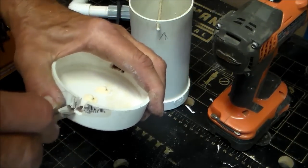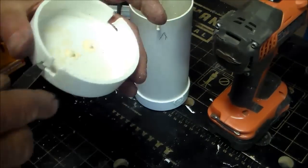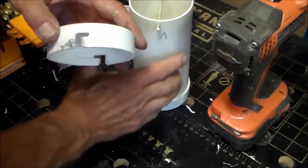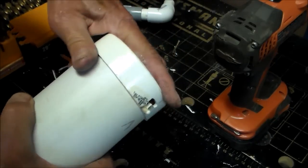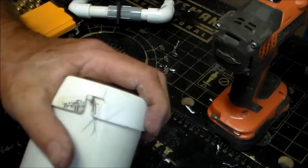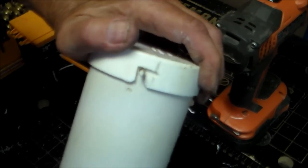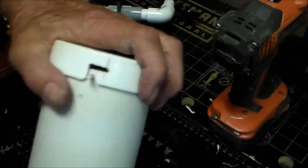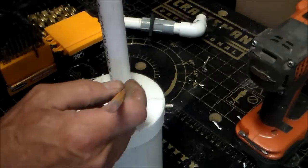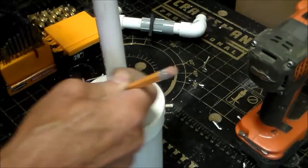My file won't fit inside these horizontal slots, so I'm going to use my pen knife to trim these out. Perfect fit — now I need to make a center hanging bracket. A hole for the fill tube needs to be drilled. You have to make sure that you don't put the hole over top of where the fiberglass rods are, and the hole should be close to one of the sides.